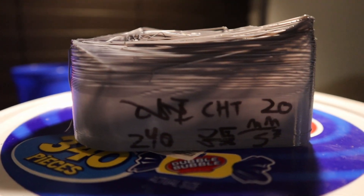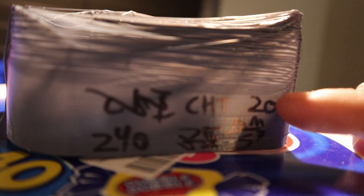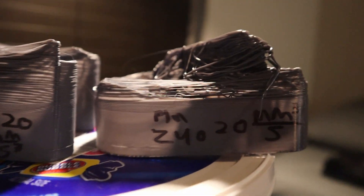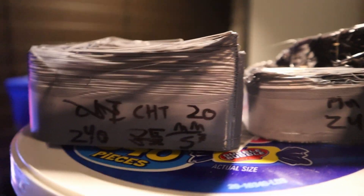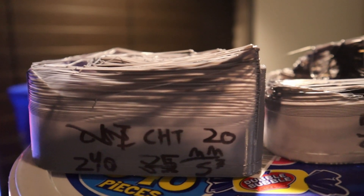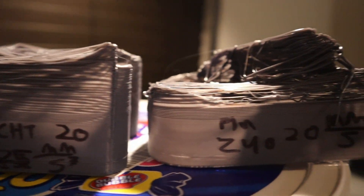This is the CHT nozzle at all the same settings. You can see the same usable flow rate at 100% at 20 mm³/s, but interestingly, this one kept going where the normal nozzle failed. Over time it doesn't drop as quickly with the flow rate, so you're still getting pretty high demanded flow.